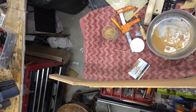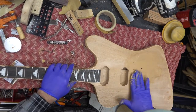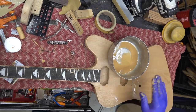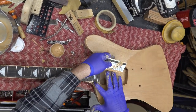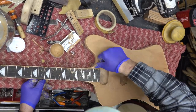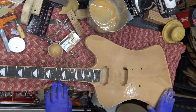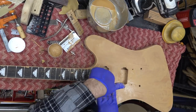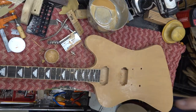I'm going to come back with a toothpick and make sure I don't plug the holes I'm using. Same process for the top as well. A credit card helps pick up the material and move it around a little bit more, making sure you're getting it in all the pores. This is a tad messy, so you're going to have to come back and scrape the binding again and clean it all up. I'd say this is one of the messiest parts of working on a mahogany guitar.